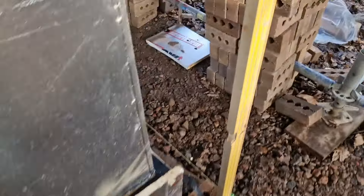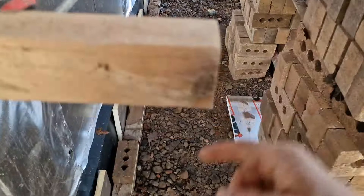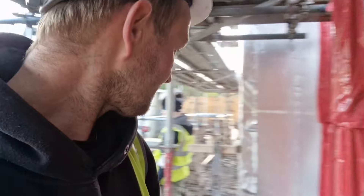What we're doing is 180 lines, 75mm cavity. We're putting out these little gallows brackets just for the splash so I don't have to move all my big profiles across, and then we're running lines across. I'm just marking out where my air bricks are going, and then we're going to continue down all this back section as far as we go until we meet the other gang. The other gang are going down the other side — we've started across the front and down the side, they've started down the side and the back. It's a straight run down here so it shouldn't be too difficult.